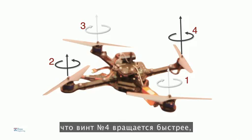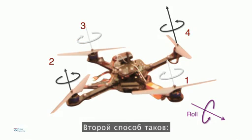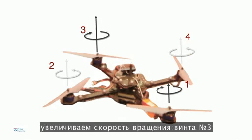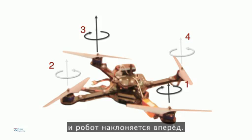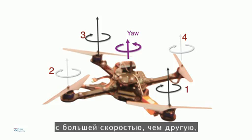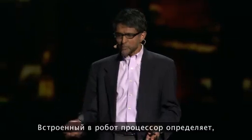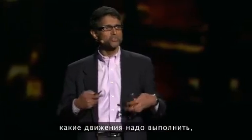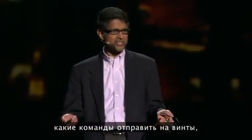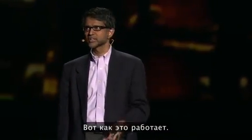In this picture, you see that rotor four is spinning faster and rotor two is spinning slower. When that happens, there's a moment that causes this robot to roll. The other way around, if you increase the speed of rotor three and decrease the speed of rotor one, then the robot pitches forward. And finally, if you spin opposite pairs of rotors faster than the other pair, then the robot yaws about the vertical axis. An onboard processor looks at what motions need to be executed and combines these motions, figuring out what commands to send to the motors 600 times a second.